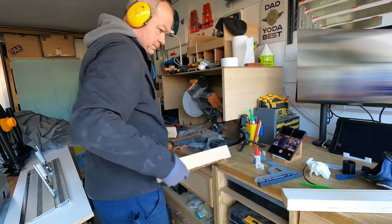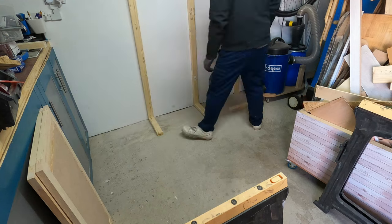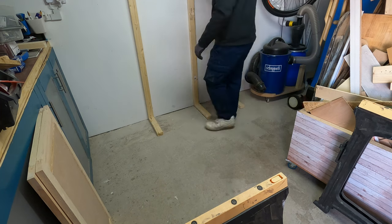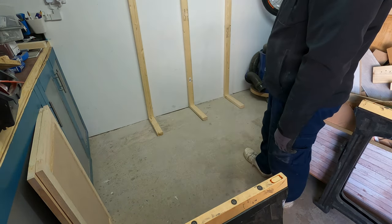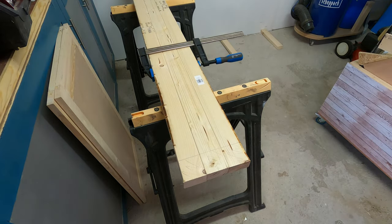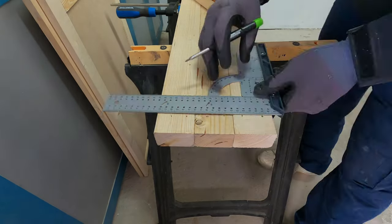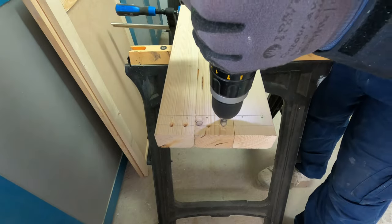The wood was a bit knotty but actually these knotty pieces were the straightest. I spent a long time going through all the pieces I got from Wickes to make sure I had the right ones. I then offered them up against the wall with the leg coming into the front — this is mainly to stop it all tipping forward and pulling the entire wall down. When I did put the fixings in I drilled all the way through into the brick, but I didn't use concrete bolts, so having the feet was the most important thing. This was my first mistake — I had the wood the wrong way around, width-wise rather than length-wise — but when I sorted that out I got them in the right place.